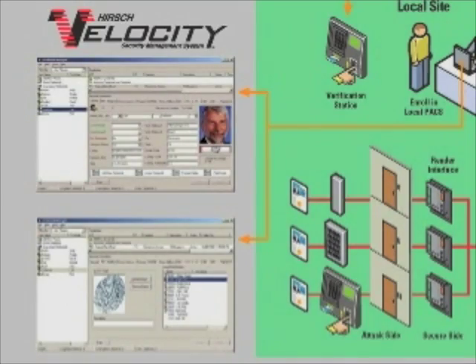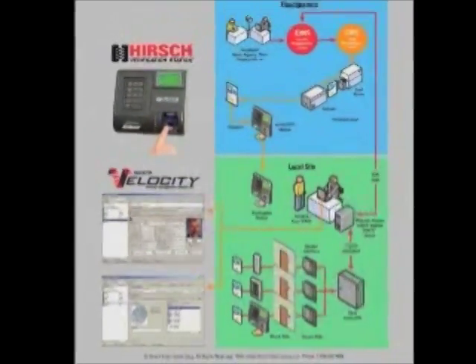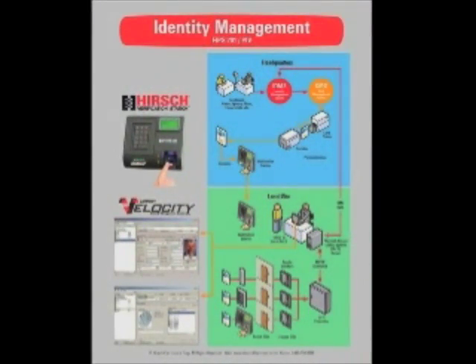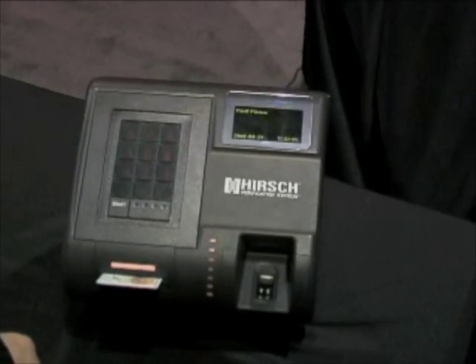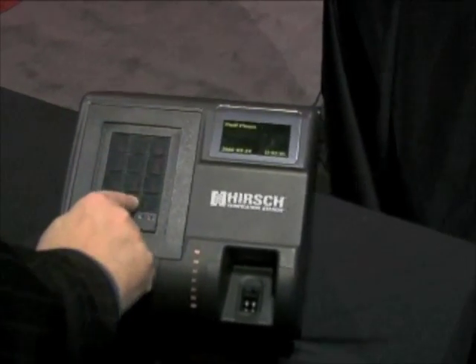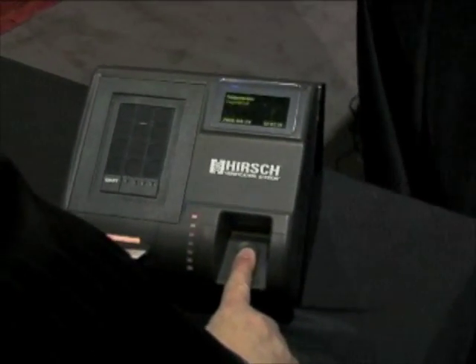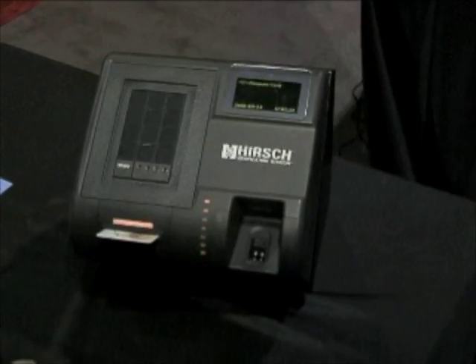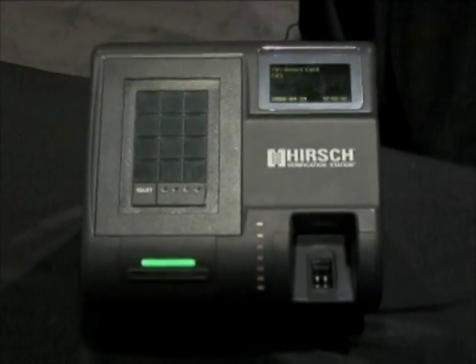The PIV Verification Station operates similarly to that shown earlier, but in following the standards mandated by FIPS 201, the PIV Verification Station requires a PIN code, fingerprint, and a contact smart card. The Verification Station will read the PIV or TWIC cards, FASC-N, and expiration date from the CHUID container. If the card, code, and fingerprint match, and if the unit is networked to the required infrastructure, the Verification Station can also validate the Public Key Infrastructure, or PKI, certificate on the card by contacting a certificate authority or an Online Certificate Status Provider, OCSP, and checking the Certificate Revocation List, CRL. The result — most commonly certificate valid or certificate revoked — is returned to the Verification Station for appropriate action.